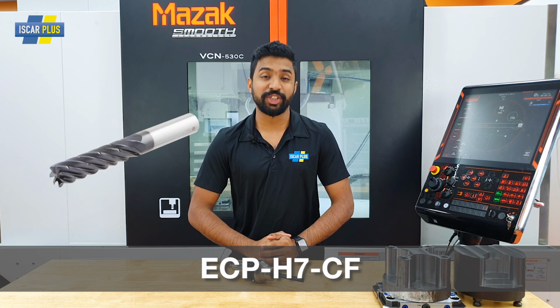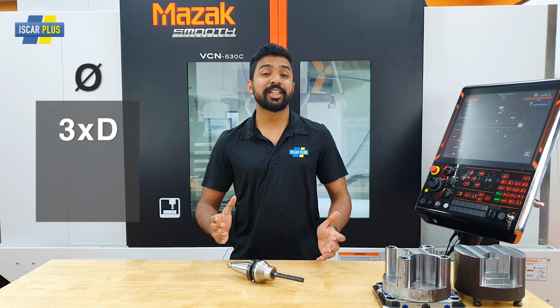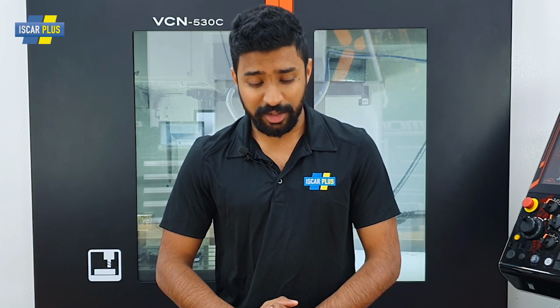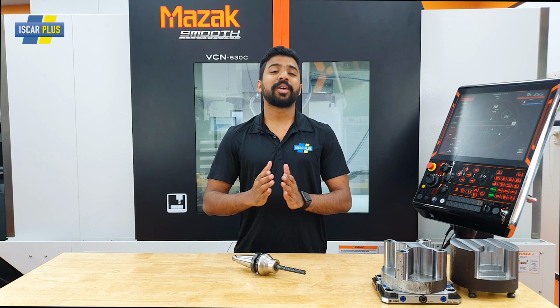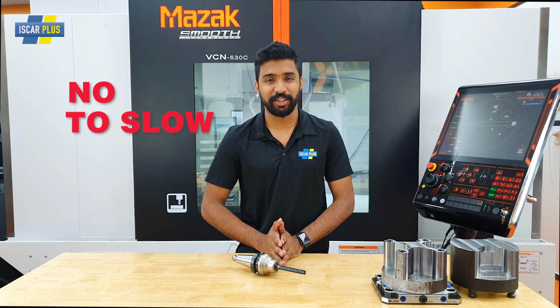This, my friends, is the ECP-H7CF from the CHATTERFREE solid mill line from Iscar. It is a brand new 7-flute cutter that is available in 3 times, 4 times and 6 times diameter to length ratio. And you must be thinking, 6 times, isn't that going to chatter like crazy? And yeah, it is going to chatter like crazy if it was somebody else's tool. But this is Iscar, and here we say no to slow when it comes to machining.